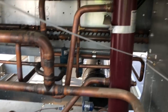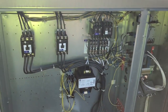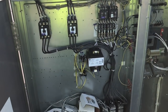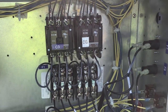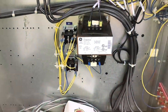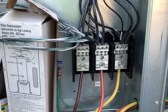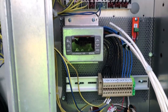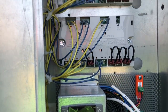That's what the compressor section looks like, along with the condensers and all that. Here's our electrical section — basically like the other one, nothing too complicated: two compressor contactors, two condenser fan contactors, a transformer, and terminal boards where our lines come in.